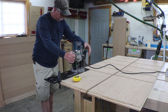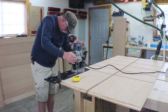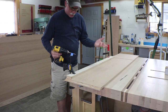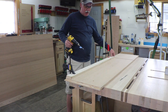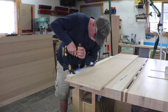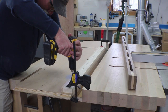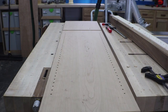In this method, all I did was add a piece of blue tape to a drill bit so I don't drill too deep, and I marked where I wanted my start and stop. I've lined it up with the slot on here so I have a good reference point, and all I'm going to do is just drill these holes. Just like that, one side is done. I've got to do the other side of this cabinet and then the two sides for the other cabinet, so I'll spend the next little bit in the shop getting that done.